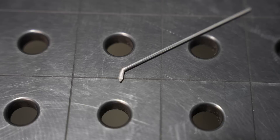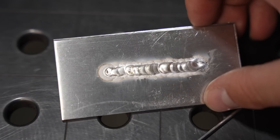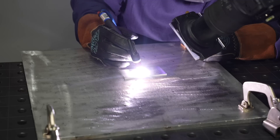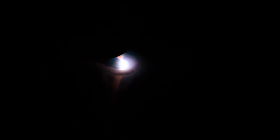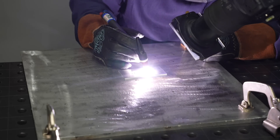If you start to see your filler metal drooping down and melting, stop. Don't shove that in there — it's going to be full of contamination. Just take a minute, diagnose what's going wrong, clip the end off, and start back up again. All of the contamination or oxidation that gets on the end of that filler is going to end up in the weld. The solution is practicing welds with proper arc length — an exercise in my online courses — where you watch how the oxidation etches off the material and push a puddle forward with good arc length and torch angle before the complexity of filler is introduced.